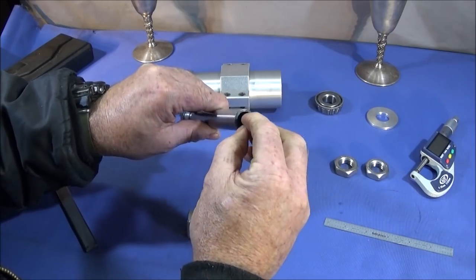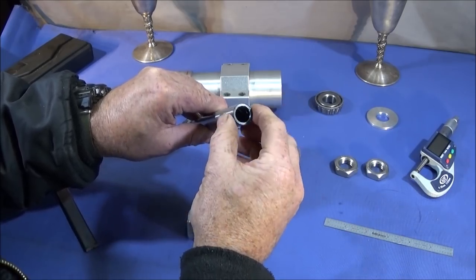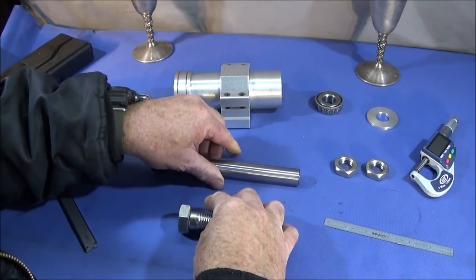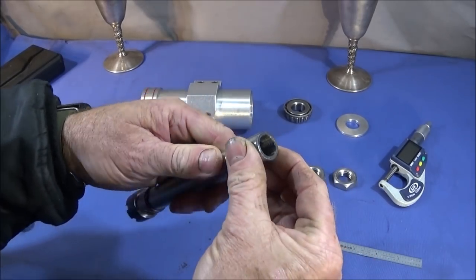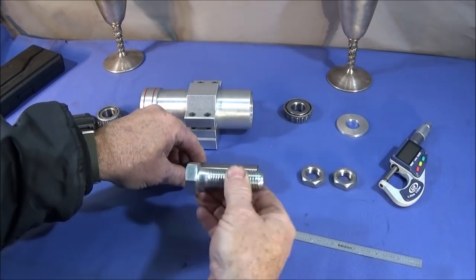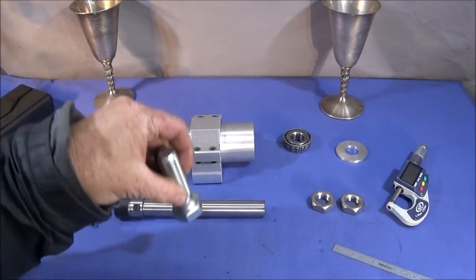I've noticed there's a little step inside as well, so there's a larger bore at the back here, and probably a bore which is about 5 to 10 thou smaller in diameter, about 10mm down. So I need to first clean those two bores with my Dremel. So the black finish has been thoroughly cleaned off, and it's all nice and shiny inside now. And I do it first like that because I want to be able to machine this component dead accurate fit on that bore.